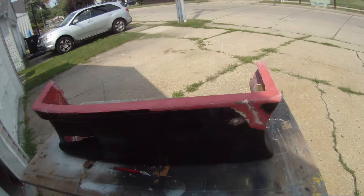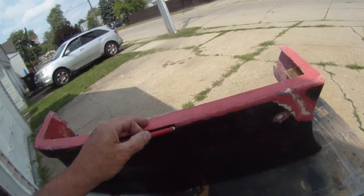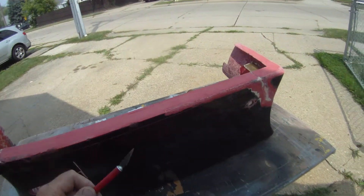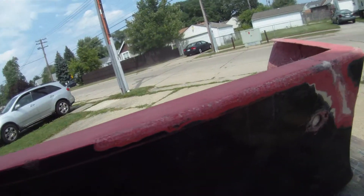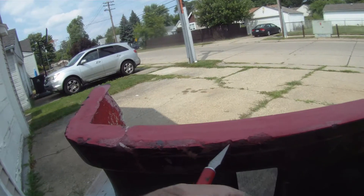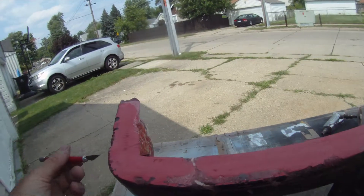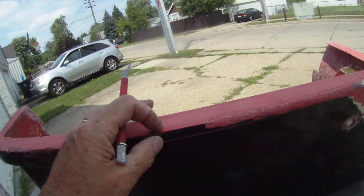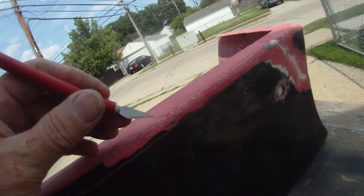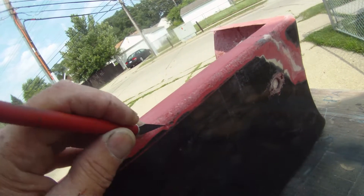Anyway, the look of the repair as you're grinding down to the good, healthy stuff is a little different. As you see here, all this stuff here looked just like this — it was all busted up and broken. I'm just grinding through the gel and the buildup from inside the mold to get down to the glass, and you also have to get past all the loose and broken bits. And there's a void there, a little air void there.